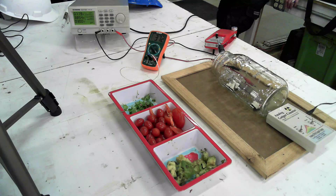Do we know how warm the glass is, to see if it'll be a problem with polycarbonate? 50 degrees. I think polycarbonate is pretty good to 100 degrees, with those spacers. You might need to have more spacers off the base so it's more centered. But there's a potential that you could use polycarbonate at this temperature. And they use that in bulletproof shielding.